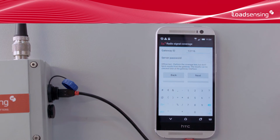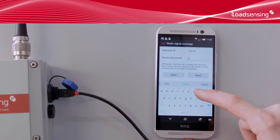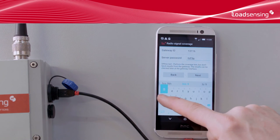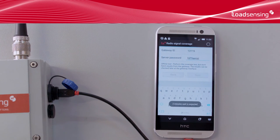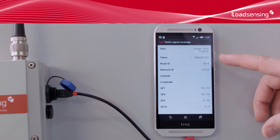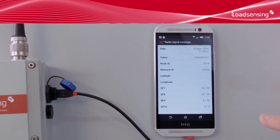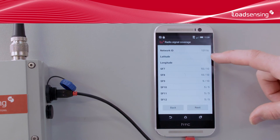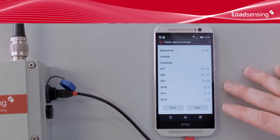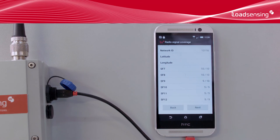For the online test to work, both the gateway and the smartphone need a working internet connection. An offline test option is available in case it's not possible to perform an online test. In order to perform the test, we need to enter the gateway's serial number and remote access password. This is the password used to access the gateway from the internet. It's separate from the radio network password, but it's initially set to the same value to avoid confusion. Once the test is done, the results will give us a measure of the quality of the connection between the gateway and the data logger. The token ID is the number which identifies this test. The spreading factors are different modulations the data logger can use. On normal operation, the optimal spreading factor will be automatically negotiated with the gateway. A coverage test is considered successful if at least half the packets can be delivered in any spreading factor. In this case, the coverage is perfect in all modulations.